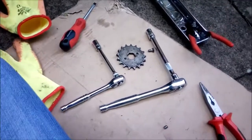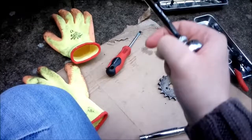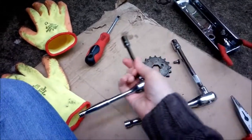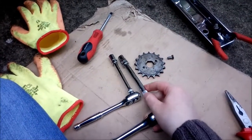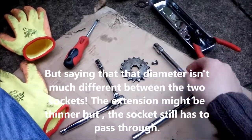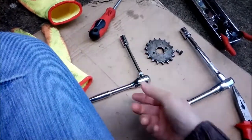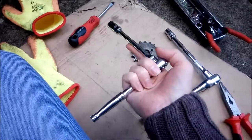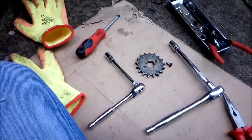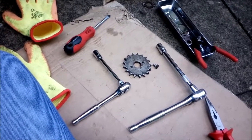I know a lot of people say it goes up to fifteen and they use them up to fifteen — because sometimes you can't get it in there, and you've only got the space that you can get a thin quarter-inch socket and extension in there. It is a lot thinner than the three-eighths extension and socket, but not all that much really. Wherever you can get away with using the three-eighths at least, I'd do that. I could really feel the ratchet not liking it at all — the strain on there for the quarter-inch — and that was only a ten millimetre. It's the application, what you're fixing is going into or coming out of — that makes the difference.